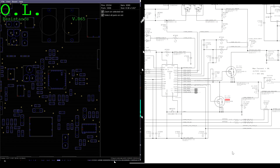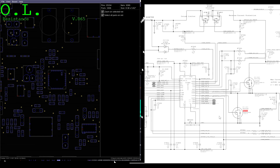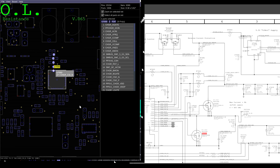The first thing we have to do is check out the current sensing circuit. We need to make sure the resistance between pins 27 and 28 and pins 17 and 18 is what I'd expect given the resistances in those areas. This is a current sensing resistor — there's going to be a small voltage drop across it, and the ISL6259 reads that drop, but only if the pathway between the current sensing resistors and the chip is intact. The current sensing circuit is working as it's supposed to.